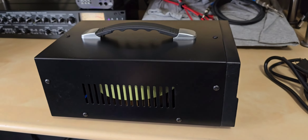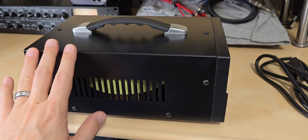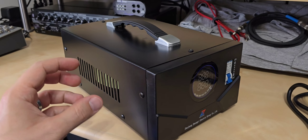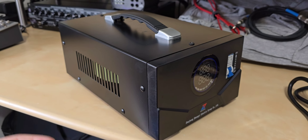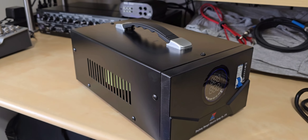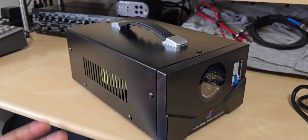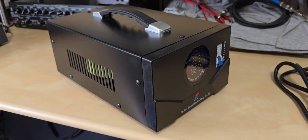After I got that piece of hot glue out of there, I went ahead and plugged it in for the first time. One thing I really like about this unit is that it has a soft start. The soft start basically allows the transformer to saturate without a really high spike of initial surge current when you first connect the toroid transformer. Because of their design, there's going to be a very high amperage draw for a very short period of time, and that has the potential to pop fuses or circuit breakers — so for a unit this large, that's a very good feature to have.